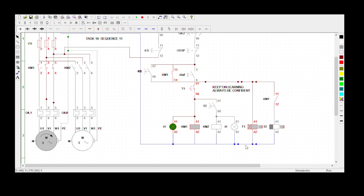We've achieved what the statement required. Power is still flowing even though Timer 2 is de-energized, because I've added a KM1 retainer contact here — this allows power to keep supplying our delay-on timer and KM1. I've now pressed the stop button to reset the process.